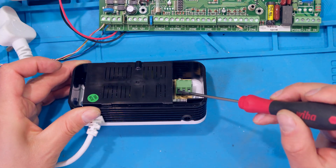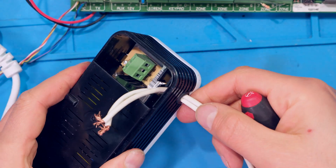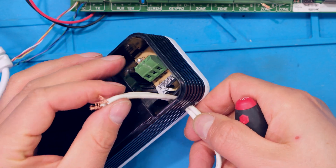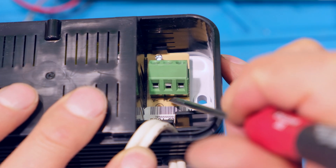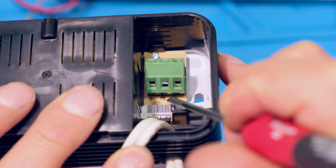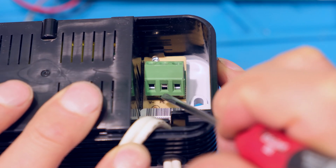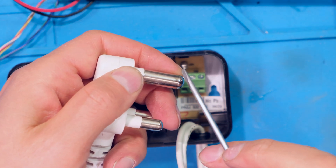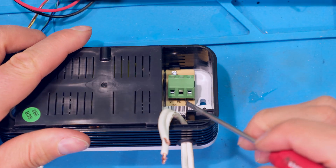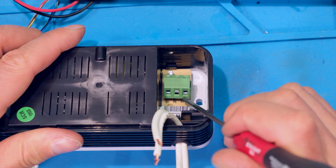I first need to connect two wires from the V-minus and the V-plus on this terminal. On the side there's a grommet, and I'm using high quality copper wire — one wire there and one wire there. There's going to be about 24 volts across the V-minus and the V-plus. There is a third terminal called PE — the earth potential — but in the majority of installations you will not need to use the PE terminal, so we are just wiring V-minus and V-plus.